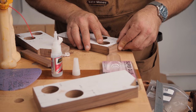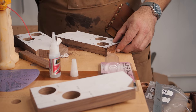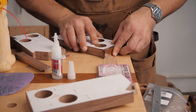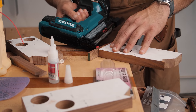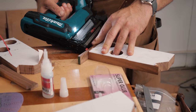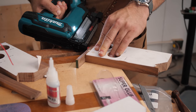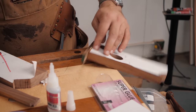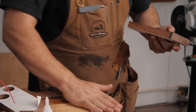Leave about a quarter inch of overhang, spray a little accelerator — this is that Tay Tools super glue that smells so good. Let that dry, throw a couple of pin nails in there. If you have a SawStop, make sure they're high enough that you'll never hit them. When this heel wears off, you can just glue another piece to the back and flush trim it.